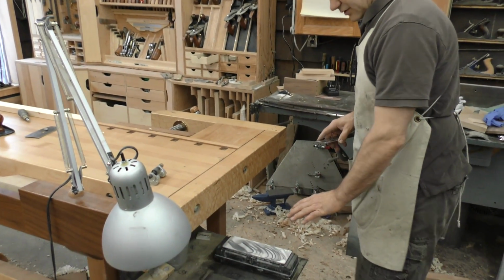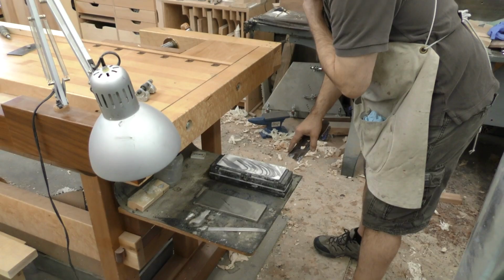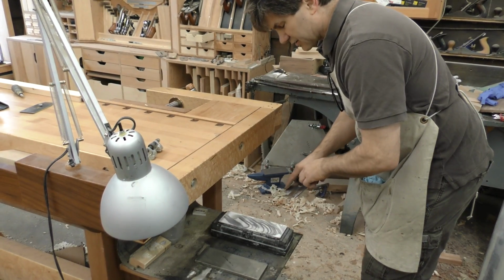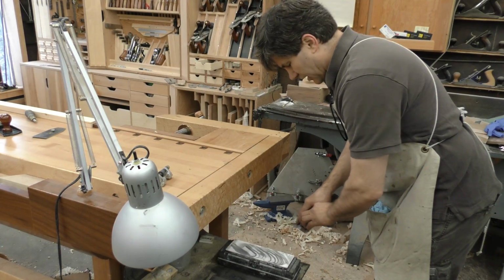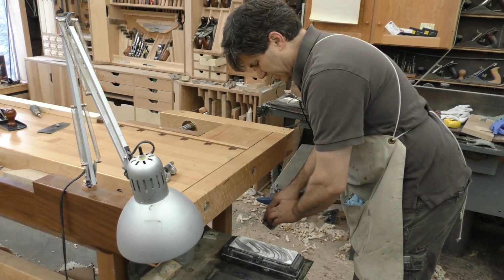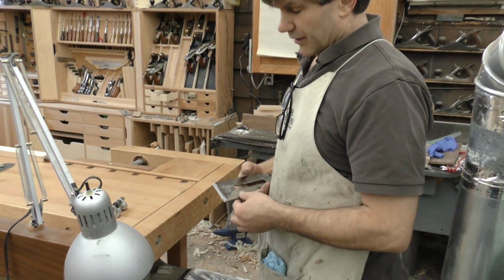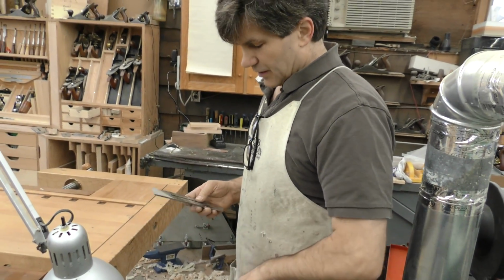What I discovered is if you keep it down here, by leaning over the stone, you're pivoting from way up here in your shoulder. You can leave the wrist and the elbow locked, much easier to do. And then to cover the entire stone, instead of having to do two motions at the same time, you can simply rock with your feet, heel and toe, while you're doing this controlled motion of holding that angle to do that bevel. And it seems to work. Folks are able to do it. All right, that's just my opinion. Try it, see.